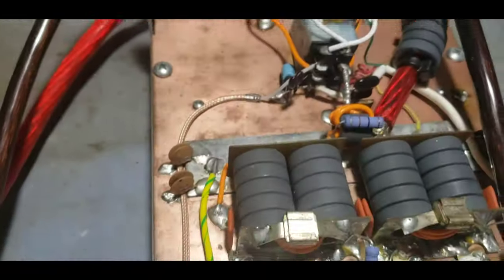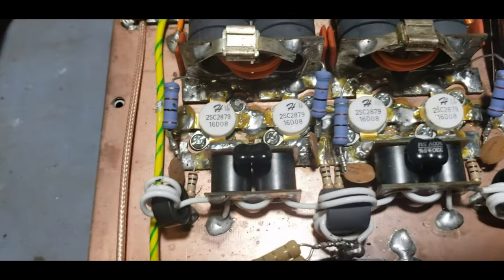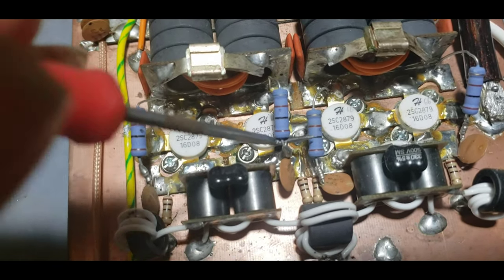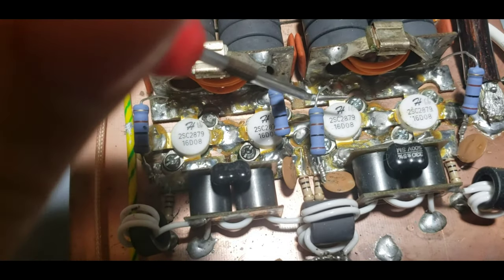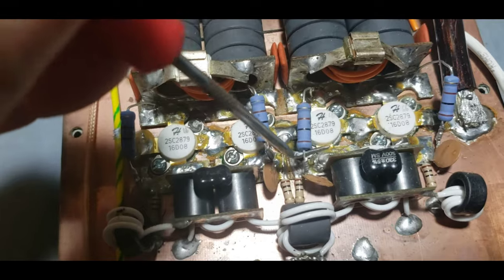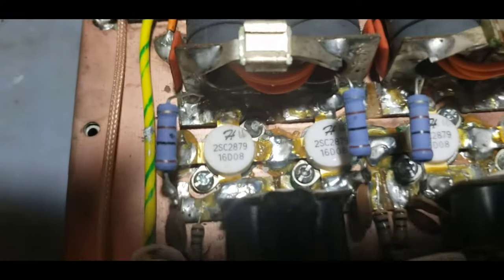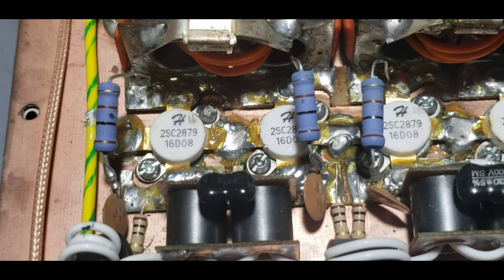There's the other nutsert. Let me put them back on — got one right there, one out in the front. I don't know what's going on with these feedback circuits — they've been pushed down. Look at this, they're bent down. This is a good little tester to make sure stuff is soldered good. I don't understand why they're bent. I'm gonna suck a lot of that solder up and reflow it.